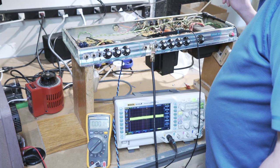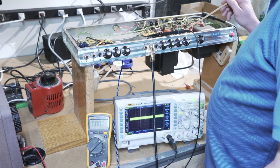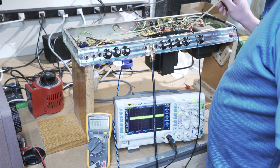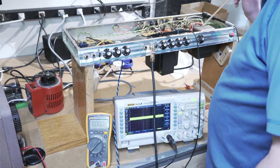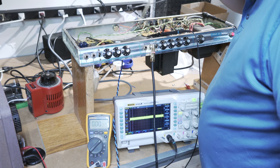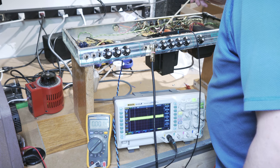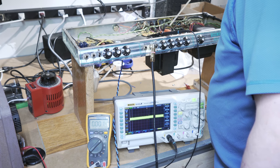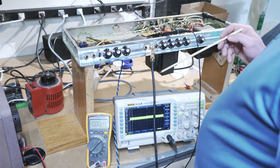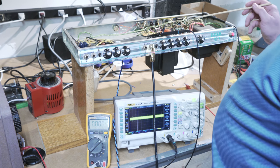I also mentioned I did see there's not some great soldering here. This is bubbled up in a funny way, so it's potential the bias could go off at any point, because there's no bias points there. If that goes bad, that's one of the filter caps for the bias. And some of these solder connections that I've seen were just tacked down. If you looked at the connection here, it's like they did a J-hook a little bit, I guess, but it's not a great one. This one looks like it's tacked on. That one is definitely tacked on. So whoever was in here didn't do the most stellar job I've seen.